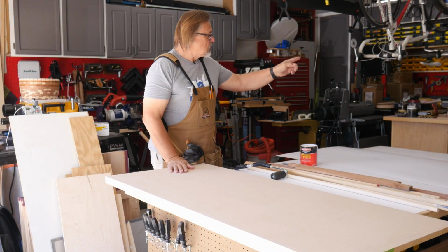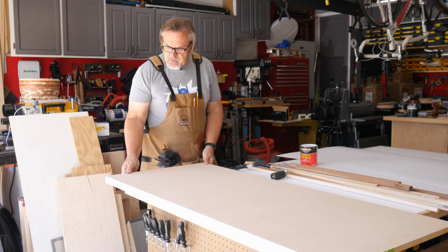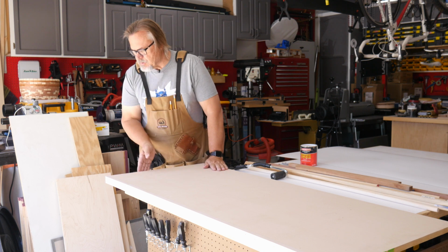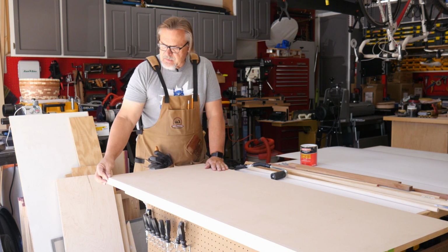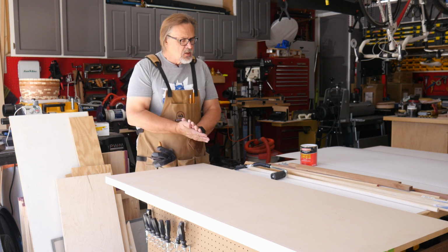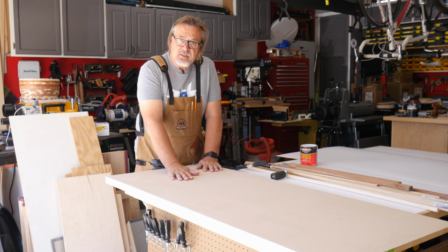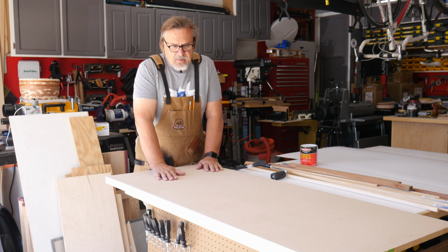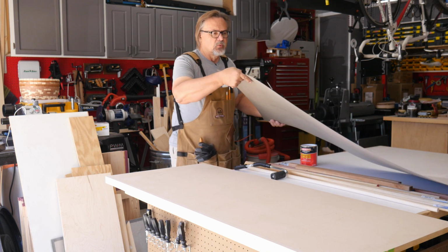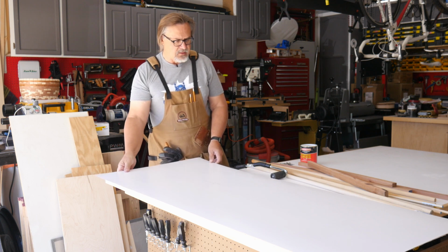This countertop is going to go on my formerly sink bench. So this is just 3/4 inch MDF. I made two cap strips to go on there, nailed them in, countersank, and sanded everything smooth. You want something durable as a finish on top. Now you could just finish this and that would work okay, but I found that Formica really works well and is durable, easy to clean, and easy to maintain.